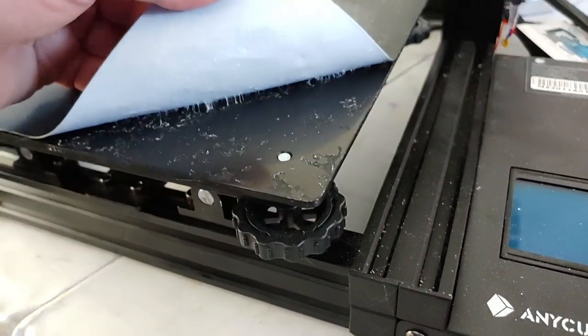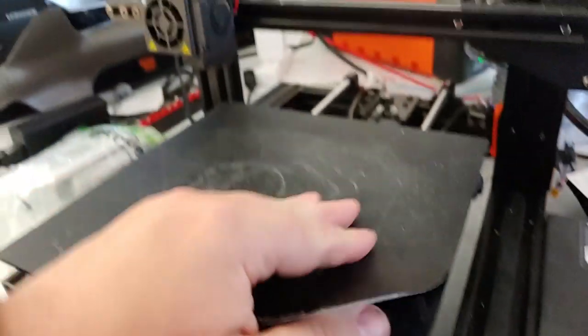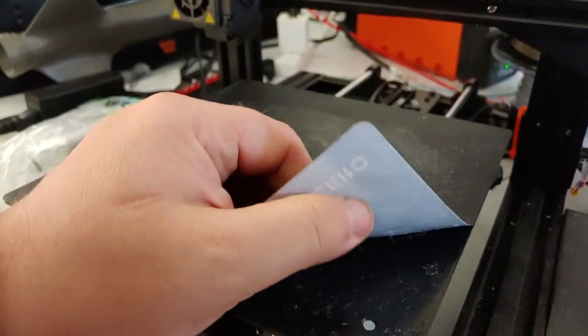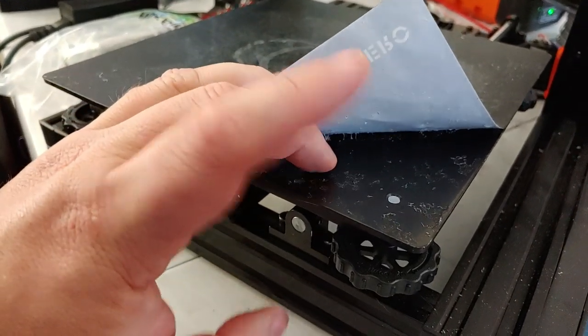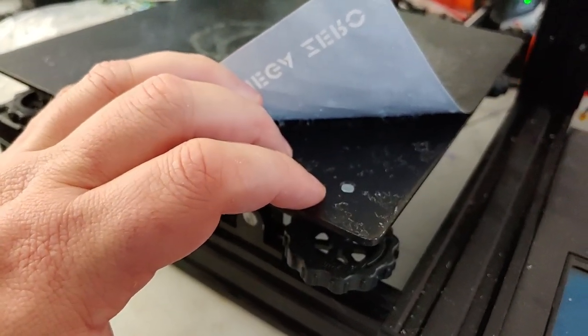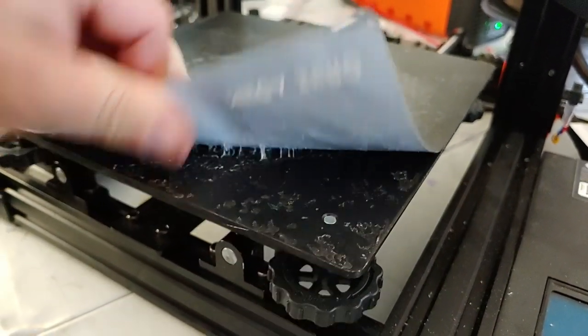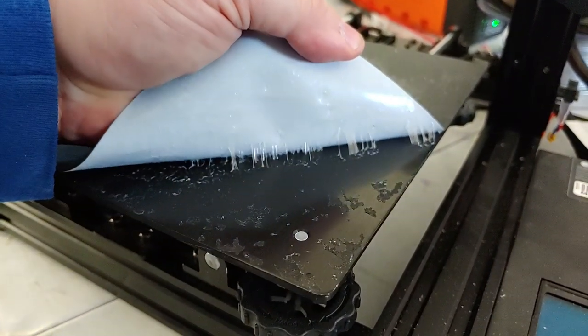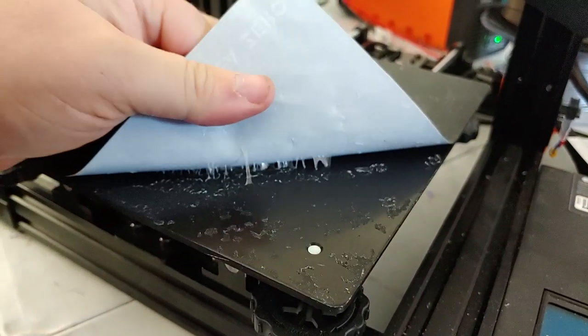I used my chisel to poke into the edge here and begin peeling it up. Now I have enough up that I can peel it up with my hands, just gently. You want to make sure you support the bed on this side as you peel it up. Don't try to just rip it up — not only will it tear, you'll leave more adhesive behind and have a larger cleanup. And you absolutely do not want to bend this bed. So be gentle. Don't bend the bed, because if you bend the bed you're not going to be able to level your printer. Just work it off slowly — even with one hand it does come off little by little. Don't apply too much force so that you don't bend your bed.